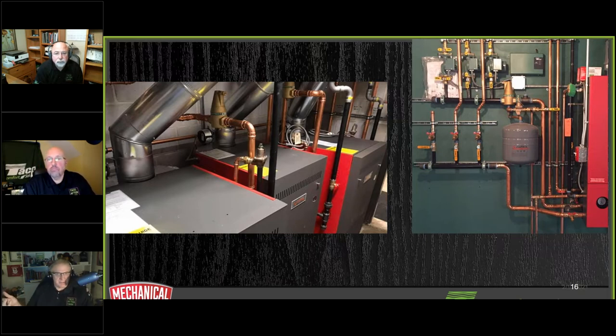Again, any kind of cleaning would just involve unscrewing the top, checking that the Pall rings are okay, and then running a rinse through the upper portion would really be the only kinds of things you would ever do. But it's highly unlikely. I've seen these things installed for 10, 15 years and no one's ever touched them, and they work just fine. So it's not a chronic thing. If something really weird were to happen, then maybe you might have to. But it's always good to keep that in mind.